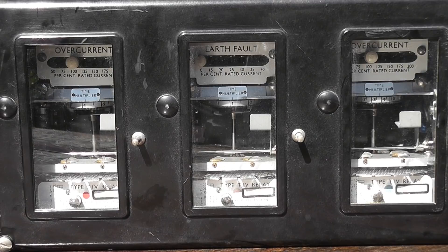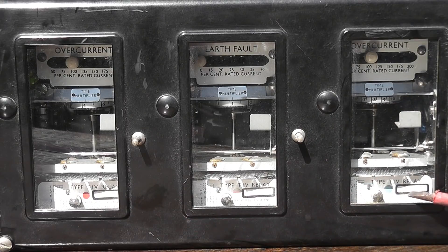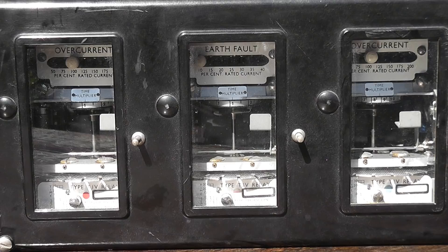As you can see, these are electromechanical relays — one on the red face, one on the blue face, and one on the earth fault protection. I'm going to take the cover off to make it a bit clearer how these things work. They are actually very cool relays and they work on a similar principle as an electromechanical kWh meter.